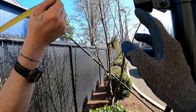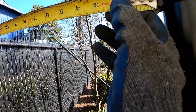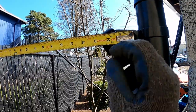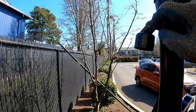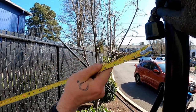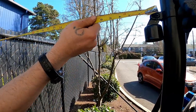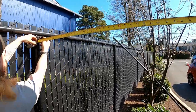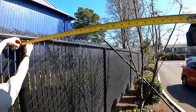Because what's happening is we're going to put it at the end of the bolt here — at the end of the bolt — and that's a one inch deduction. So it makes it easy when you guys are by yourself and you don't have to fight with that doggone thing trying to stay up there. So you just put it at the edge of the bolt. It'd be better if you didn't have a crushed tape measure like that. Then you measure total inches — 47 — and you deduct one inch.